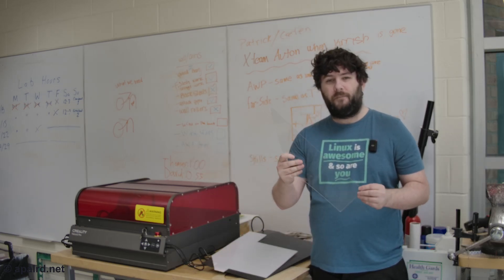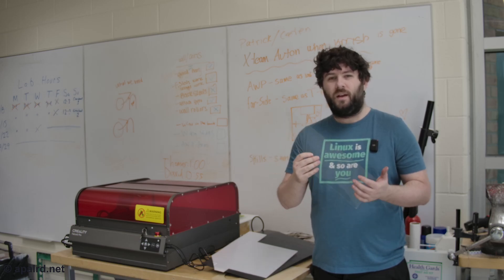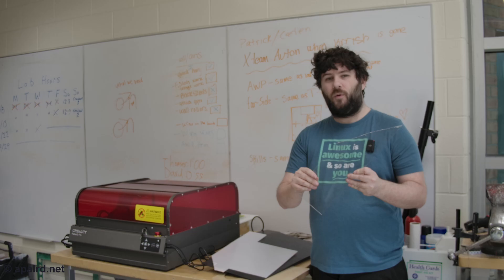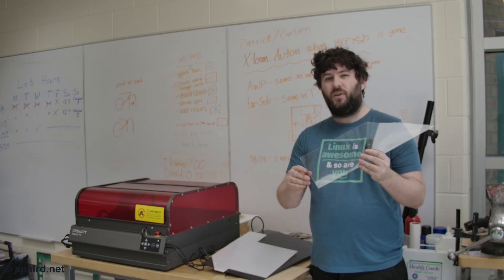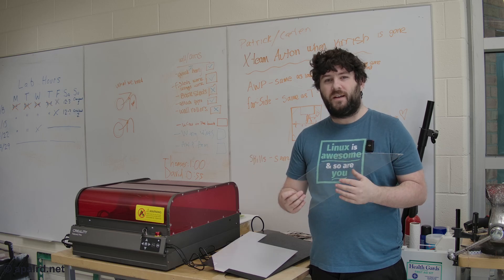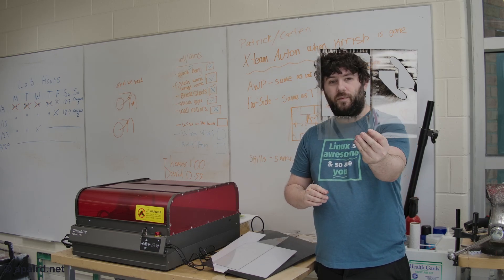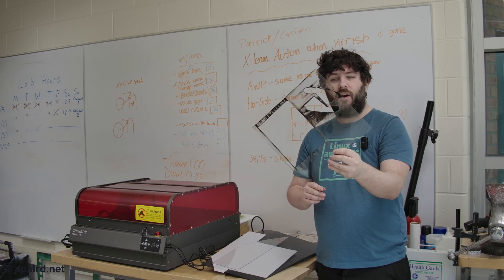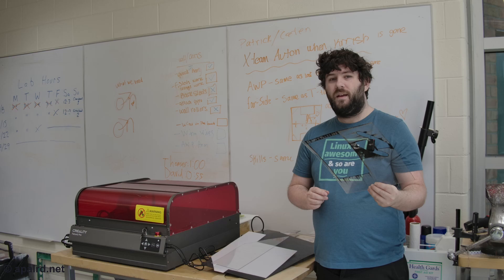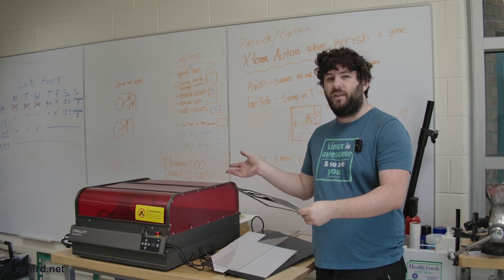Third on my list I've got polycarbonate, which is a great material. It's not brittle like acrylic — acrylic tends to fracture when it breaks, but polycarbonate will crack and won't explode. So this is the material I'm primarily going to be using on the laser cutter for robot making. Unfortunately it does burn, so you end up with charred pieces. It's not toxic but it's still something you should be careful of, which is why I vent the fumes outside.